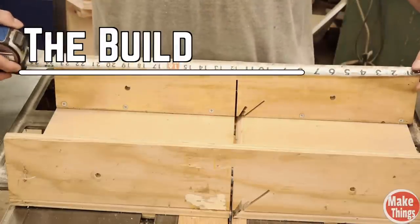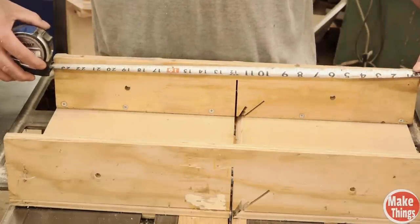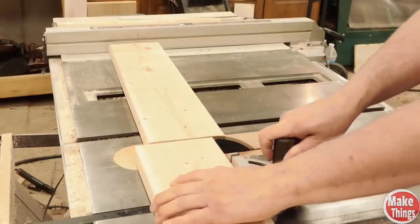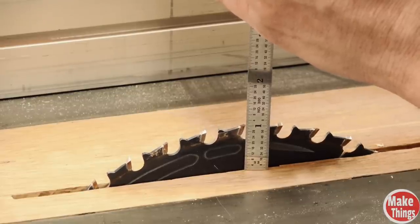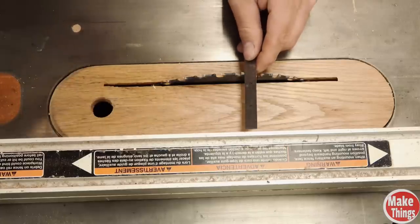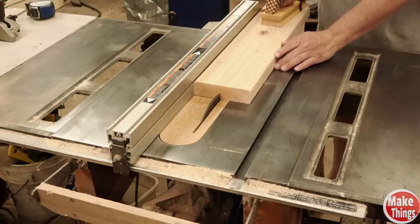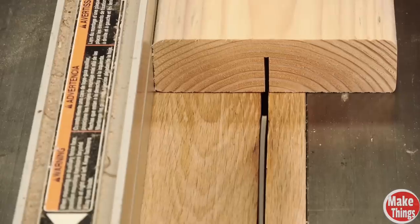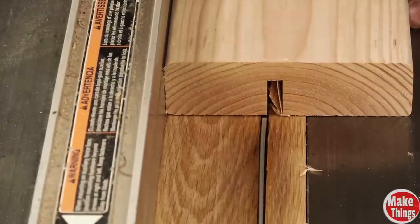Because this follows so closely to my plans that I made, I'm going to explain everything in detail as we go along. If you plan on making this jig to fit on your sled, you'll need to first measure your sled and cut a two-by-six to length. Then set your table saw blade so that it is exactly an inch from the top of the arch. Next, set the width of the blade and the fence at two and a half inches. We're going to start our dado by running our two-by-six through, then move the fence in by about a blade's width and make another pass.